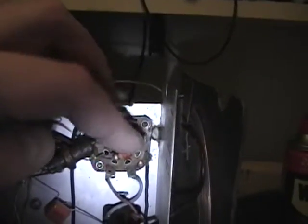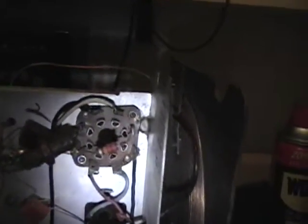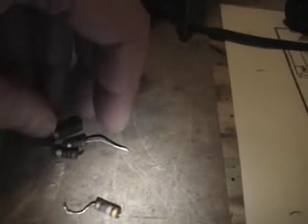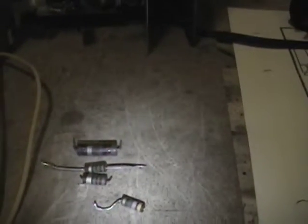Good news — I'm just about ready to fire this radio up for the first time. I replaced just about all the components. The only ones I left in were the mica caps and some ceramic caps, as I mentioned in earlier videos — those generally don't go bad. I found one resistor that measured out okay. There's a silver band on these resistors, which means they have a 10% tolerance, so if the value measured with an ohm meter is within plus or minus 10% of the stated value, it's okay to leave it in.